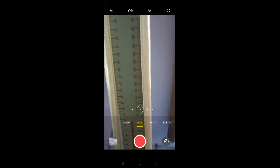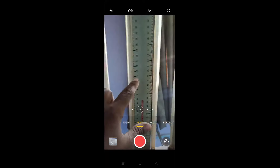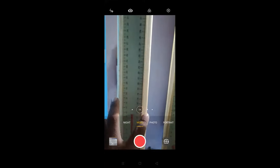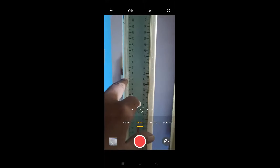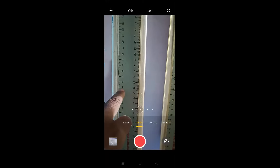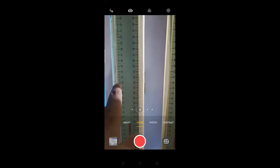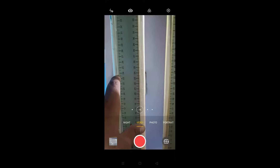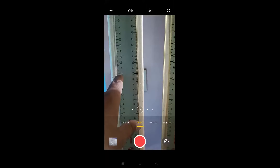Here these are the piezometric tubes — the first, second, third, fourth, fifth, sixth. There is a scale attached here in between two piezometric tubes. When water rises inside this tube, we can measure the pressure head with the help of the scale. It has a lower meniscus — a concave shape of the water surface — and the lower meniscus is taken for the reading purpose.